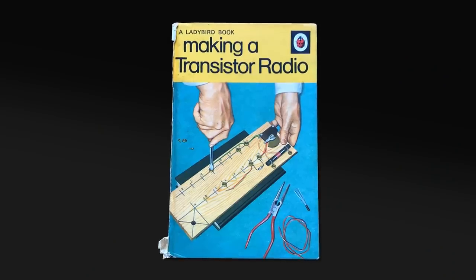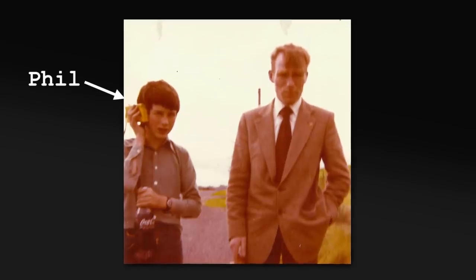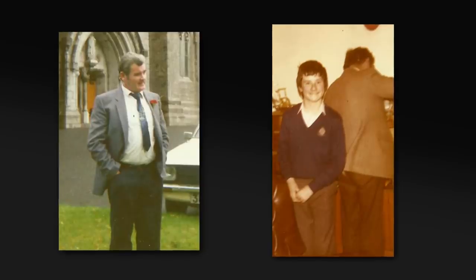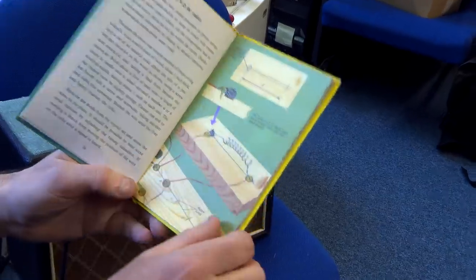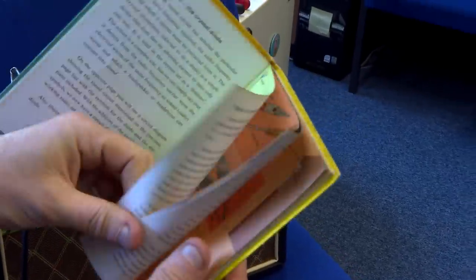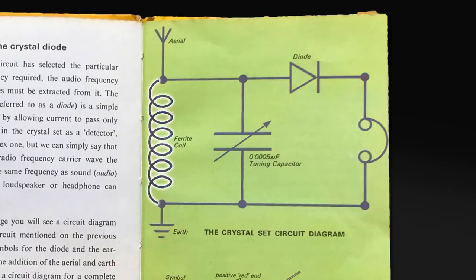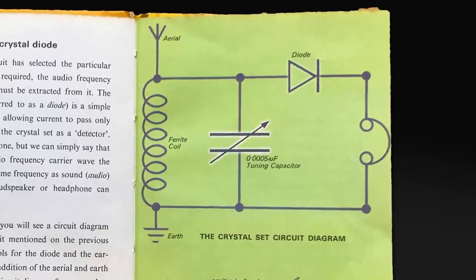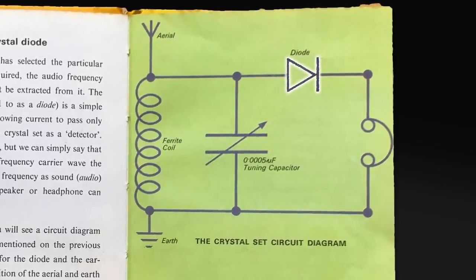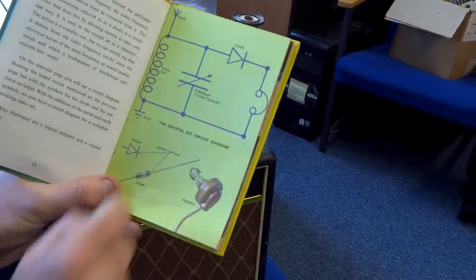This book was actually published in 1972, and this is where for me physics started. My uncle Benny was a radio amateur, really interested in shortwave radio, building antennas and getting better signals. He and I, when I was about 10, used this book to build something called a crystal radio. We've got a coil which is an inductor, a capacitor which we can tune, a diode which is a rectifier that only lets current flow one way, and a pair of headphones — or indeed I used an earpiece exactly like this.